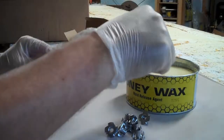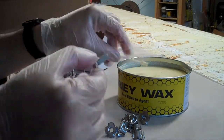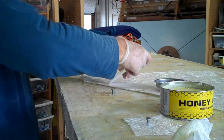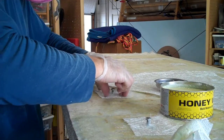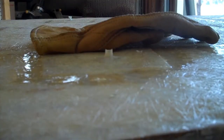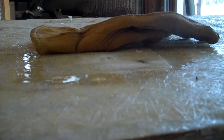For the connection between the pontoon and the deck, I'm embedding stainless steel T-nut threaded inserts into the fiberglass. I used honey wax on the hex bolts to give a handle to position the T-nuts and to keep fiberglass from sticking to the threads. I pushed the T-nuts into the bottom layer of fiberglass while it was still wet, and after that dried, I put a few more layers on top to reinforce the nut locations. The fiberglass fibers from the chopped strand mat do wrap around the bolt, but due to the wax you can unscrew them and cut off any protrusions with a saw. Note that fiberglass strands with resin are sharp and pokey — I recommend using gloves.